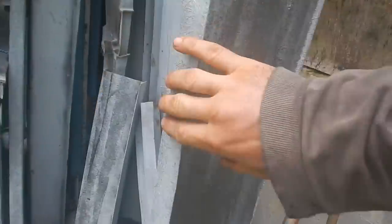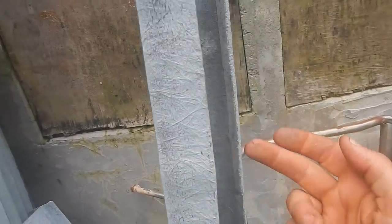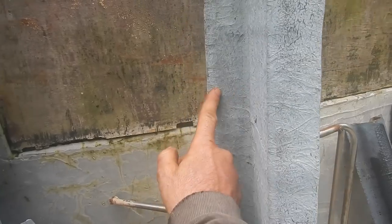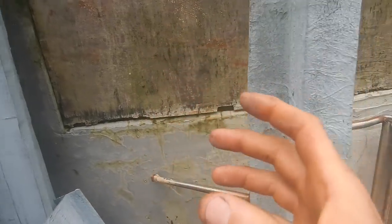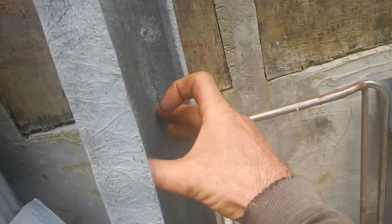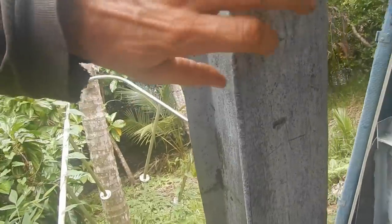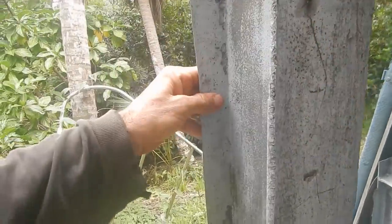Oh, you know what? The front and the back piece I can make out of this. This is stronger because it's almost like an I-beam. It's got the piece here, but then it also comes out here. So it's actually stronger. And the reason I don't want to box tube the front and the back piece is because if I don't do that, then I can attach the other pieces inside here. But if this is box tube, then it's harder to attach them. So yeah, this will be good because it has a thicker side here. So that'll be nice and strong. Okay, that sounds good.